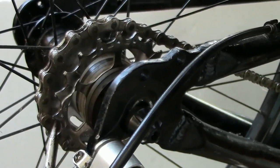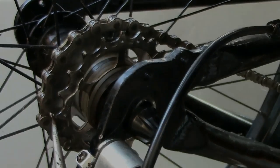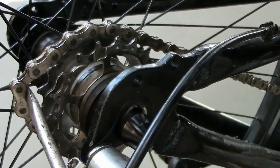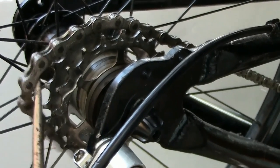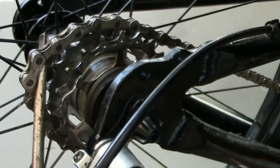After a quarter turn, the rollers appear to bottom out between the sprocket teeth. Pulling the chain away from the sprocket shows that only a few teeth at the top are carrying almost all of the load. Taking this further shows that the chain remains in stable contact with the sprocket if only four teeth are engaged.